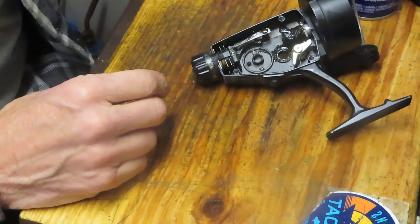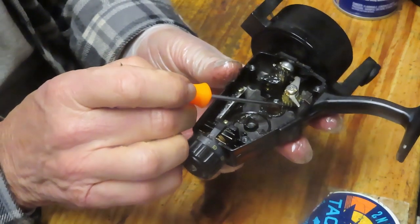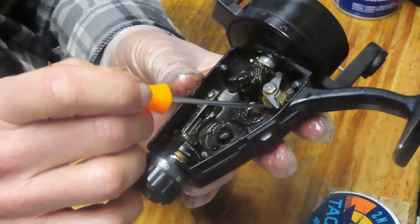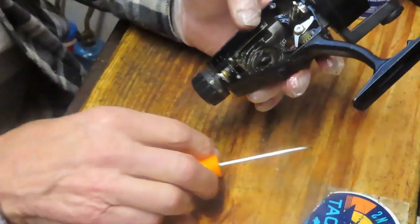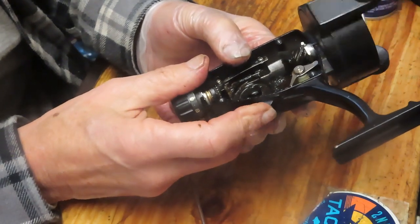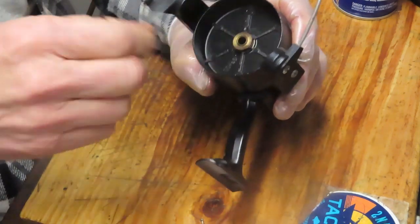Up top is a good place to take a picture. One thing I find unusual about this anti-reverse is there's a gear back here — you don't see that a lot — driven off the back end of the main gear. That drives the anti-reverse dog in and out. The anti-reverse dog catches on this ratchet up here, but it only has a few teeth, so it's not going to catch every chance — it's going to be rather abrupt. Let's make sure that's working, then take the rotor off.